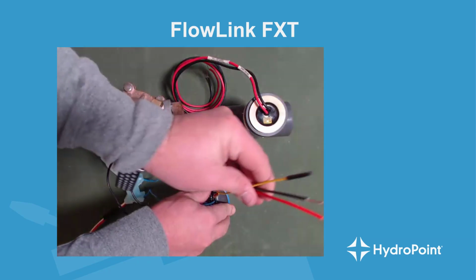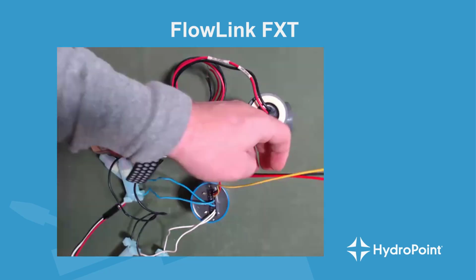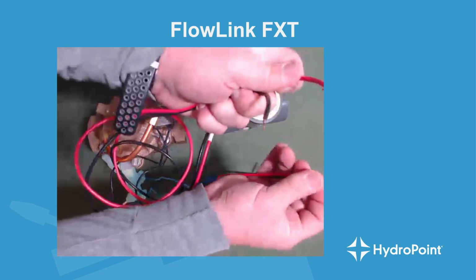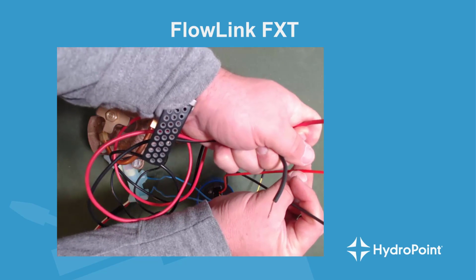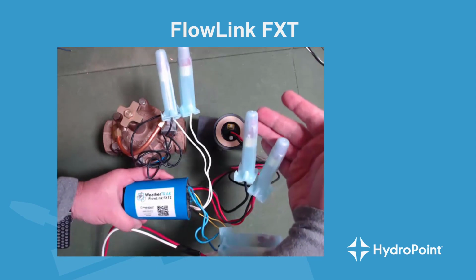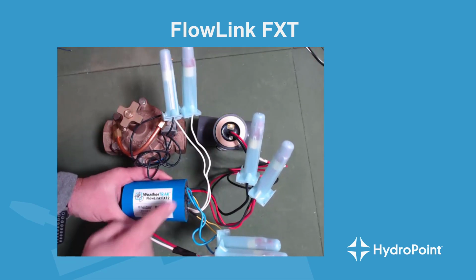Notice that the flow sensor wires have a black, a red, and a yellow. The yellow wire will only be used when wiring a photodiode flow sensor. So in this application with the T-style flow sensor, we'll just bend this yellow wire back and we'll simply connect the red wire on the flow sensor to the red wire on the FXT and the black wire on the flow sensor to the black wire on the FXT. And once I've got my red and black wires in the DBRY wire nuts, I've got my two master valve wires wired to the white leads, and I've got my two field wires or my power wires connected to the blue leads.